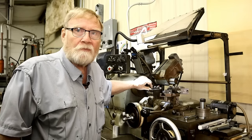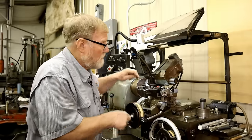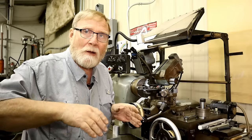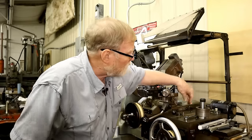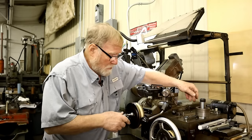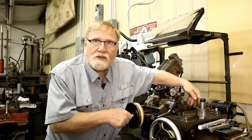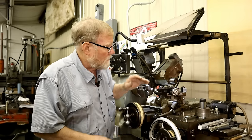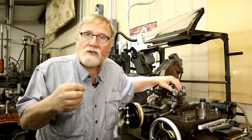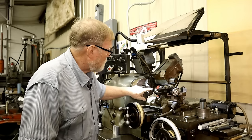of your drive spindle. And Bob has a cross slide that changes where the center of this tool holder will be. And I can slide it up and down. So to get by the limitation, what you have to do on Bob is back over here is a stop that I can set so that when I run this cross slide back across, I can go to that stop. And if I've set these correctly on the carousel, I know I'm in center, just like on a regular lathe. And I need that to drill a hole.